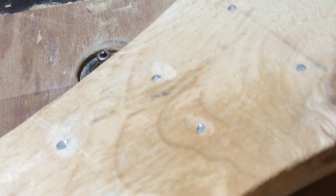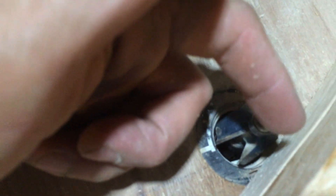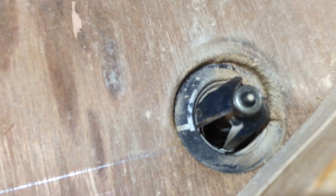Now with the guide off, we can put this on here. We're going to be real careful because we're going to have to hand-hold this. We're going to basically put two lines — one here and one over here on each side — and then go up to that line with the center of the router, slide over to the next one, flip it, and do that four times. That should get us a nice mark on there.